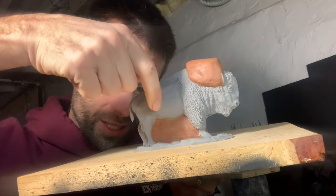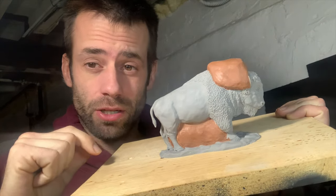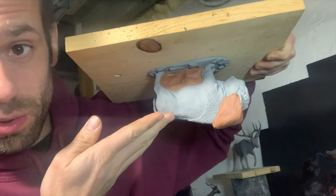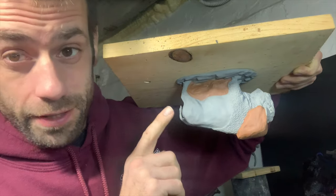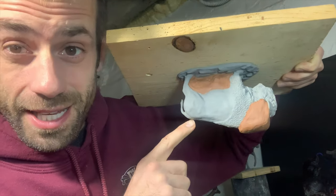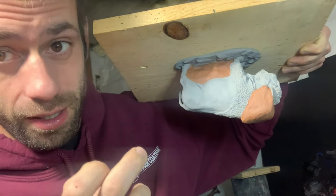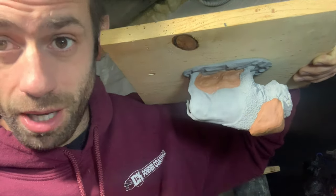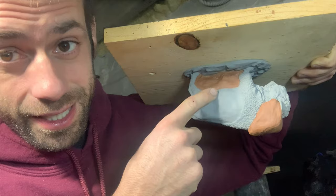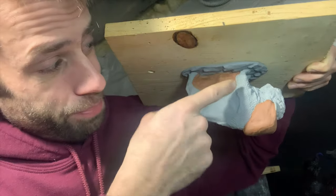I've got the plug on top and the plug in between the legs done. But I'm really starting to think I shot myself in the foot by trying to mold this with the base on. Originally I was thinking I would fill the mold through the legs and the base would be an open platform I'd also fill in. But that's not going to work. If this was a resin cast it might, but I need to cast this in wax, and furthermore I need to do it hollow. If I pour the wax through the legs, they're not thick enough to allow a hollow cast — they'll plug up before I can fill or empty the body. So I need another inlet, but I can't do that because the base is in the way.